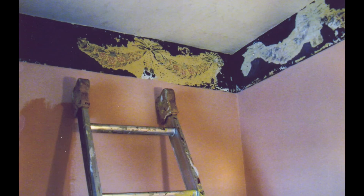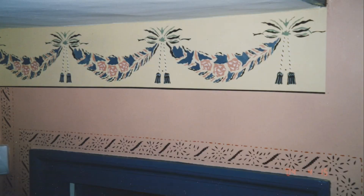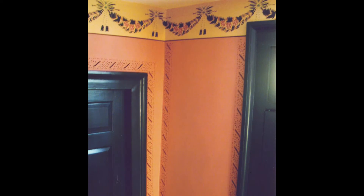This is the Salmon Wood House in Hancock, New Hampshire. They discovered a bubble of paint, and under the bubble they saw some stenciling, so they contacted me. Using super-sticky tape I was able to pull off enough paint to record it and then reproduce the stencil. The stenciling was of the most sophisticated of the time, exhibiting five colors in the swag. At least four rooms were stenciled in this house. The strong colors are correct — that is how they were.